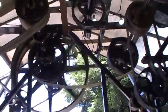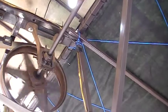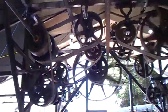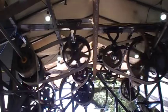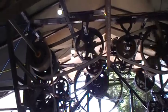I think this squealing tells me that, looking at it from this end, the right side is running just a little bit faster than the drive shaft on the left side. I calculated this one to be running about 180 RPM, and I am going through a lot of pulleys. It'll take a lot of calculation, but I probably just need to adjust my pulleys a little bit — maybe move them around and speed this left side up.